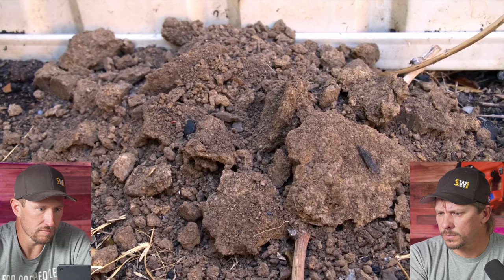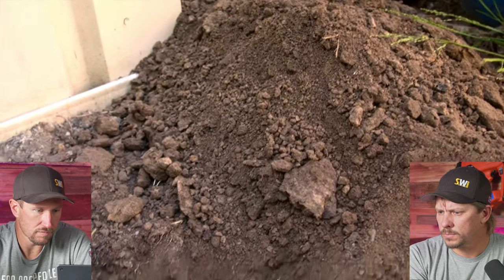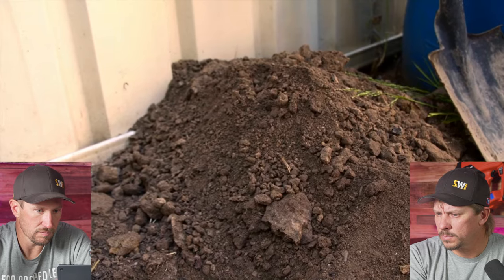As I've taken out the dirt, you can see the clay section and on the right the dirt section. The dirt section is what we put back in the hole first, with a bit of cement — because clay is very hard to compact. We've dug the hole about 21 and a half inches. Generally, if you have softer soil, you need to go deeper, at least another 100 to 150 mils. Also not taking into account frost depth — you need to get below frost, so even without concrete it's still advisable to go below frost depth.